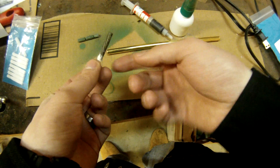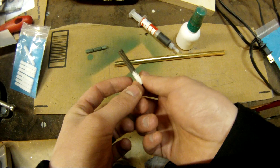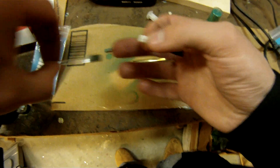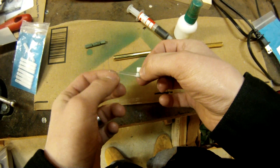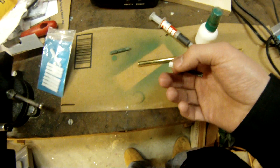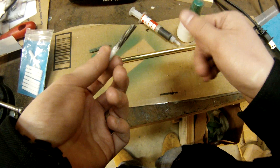You just get some of this stuff on your finger or whatever, load it on the surfaces, and then you run it. You put the keyed rod in the back, and you can make the rod as long as you need it to be, and work it. Be gentle, keep it gentle, keep your workpiece cool, and apply cutting lubricant as necessary — although these oil-based compounds are self-lubricating, which is nice.